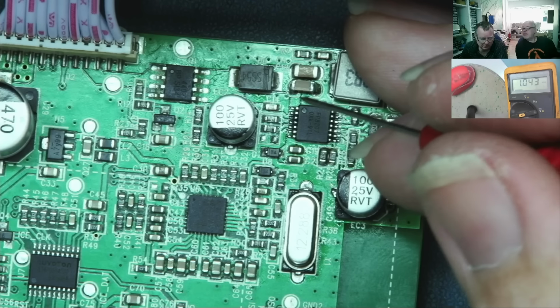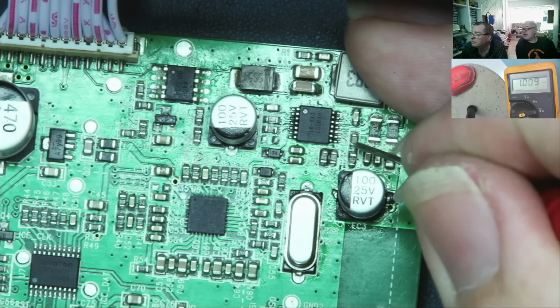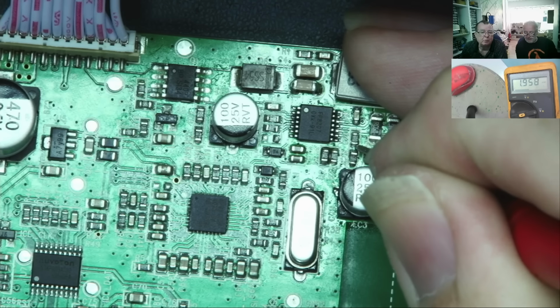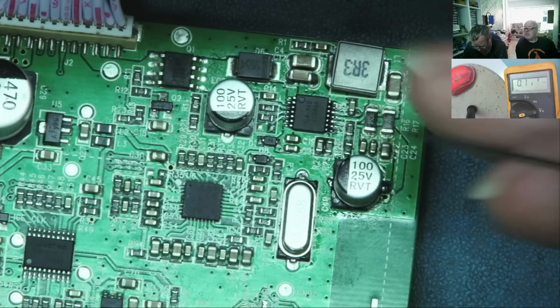Enable is good. Check pin 9, please, in the middle of the two resistors down there. Yeah, there. Should be 1.9. This is good, because this is actually the voltage I want to see. What was the reference? 2.4. So you'd expect this to be lower than the reference voltage. It is, and this is exactly where I want to see it. So there's some room to charge. So that's changing. Do you think this thing's actually charging now?